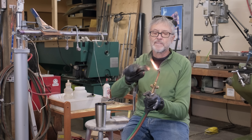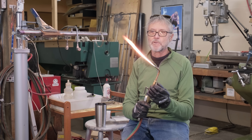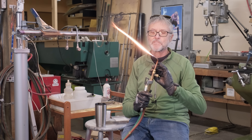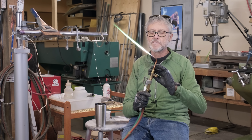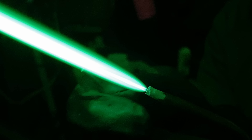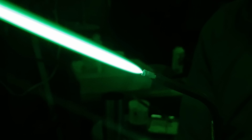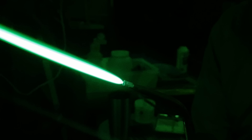We'll get it lit. You want to open it up until most of the smoke goes away — that's a good starting place. There's the cone — that excess is a carburizing flame, so close it down. We're going to close it down even more. You want a really small flame.